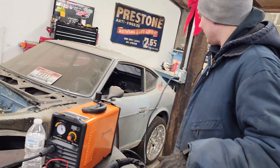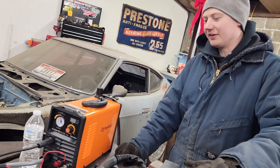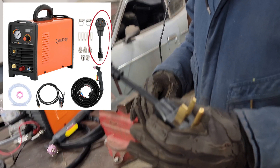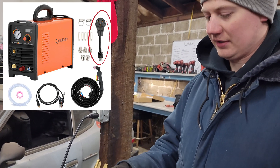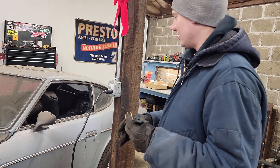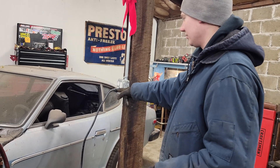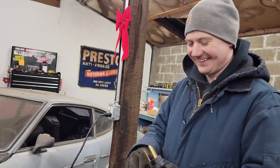Now, how's the plug-in work? On the picture from Amazon, one thing I don't like - they show the reverse of this adapter. It's got a 110, 15-amp cord end on it that will adapt to a 220 plug. Amazon showed a 220 cord end that adapts to 110, which in my opinion is a lot safer. If we plug this into 220, we'll be running possibly 50 amps through the 15-amp cord end. We'll see how that holds up.